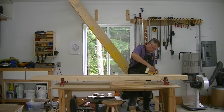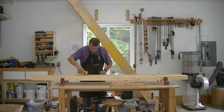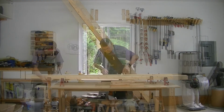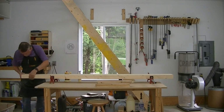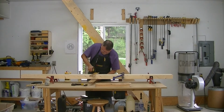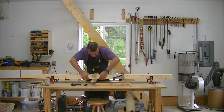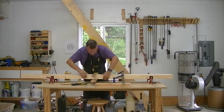Alright, now time for some assembly. I used a liberal amount of glue on the faces of my strips. Believe me, this is not the time to be stingy. I then used a process to clamp down the build, starting with some pipe clamps and some cauls to make sure that my pieces were pretty much in line. Sometimes you need a little bit of persuasion.